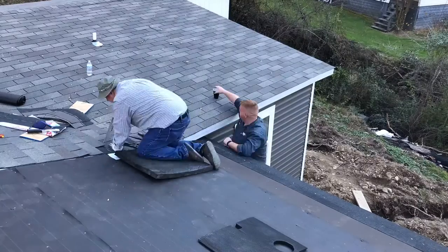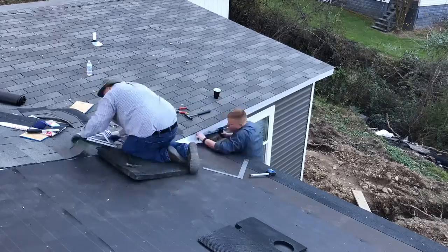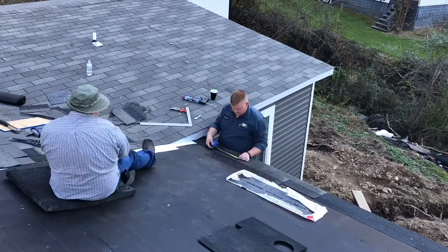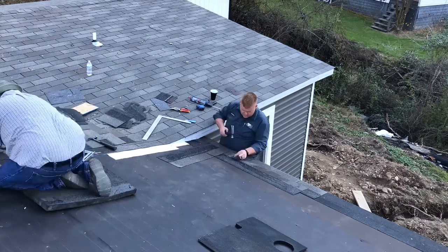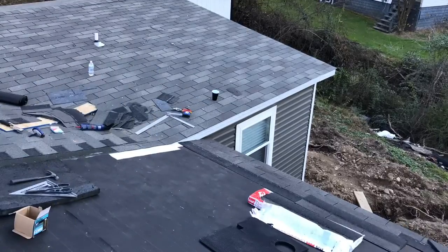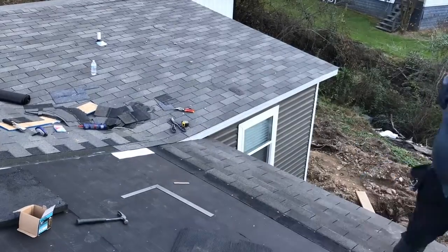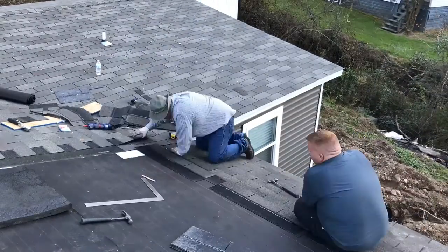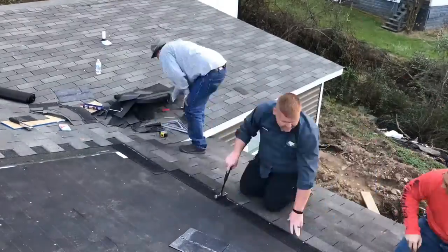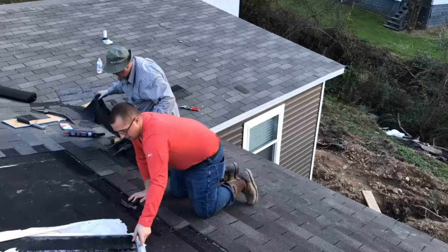We plug a light up and keep going — I wanted to finish that side. The next evening after I got home from work, I bent another piece of flashing and started on the other side: put her tar paper, starter strip, and drip edge down. As the father-in-law was pulling up the existing shingles like he did on the other side, I started laying my first few rows and had to cut them to fit up under that eave where the two overhangs meet. Then the brother-in-law shows up and we did assembly line — father-in-law on one side, brother-in-law in the middle, me on the edge cutting. We made a good team and knocked it out.